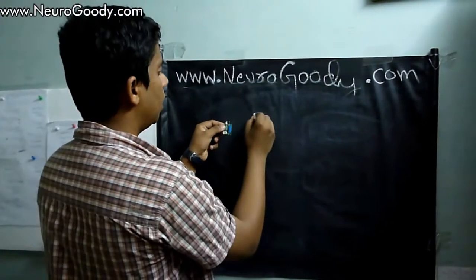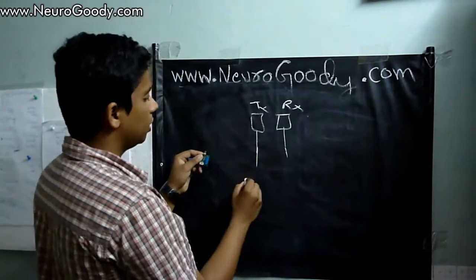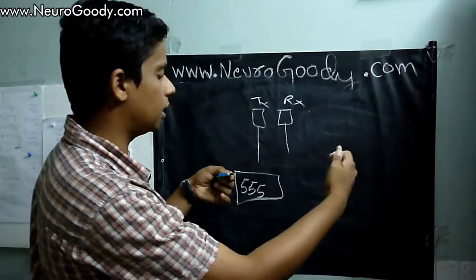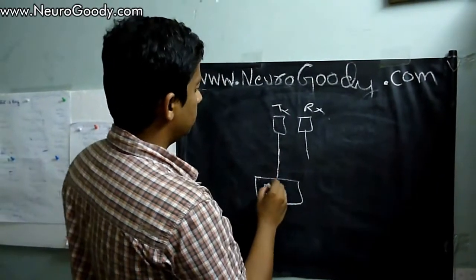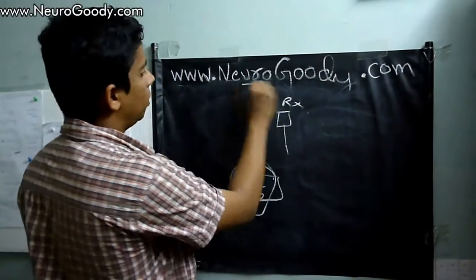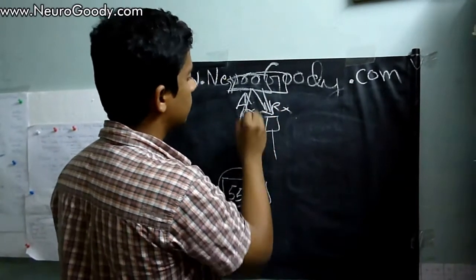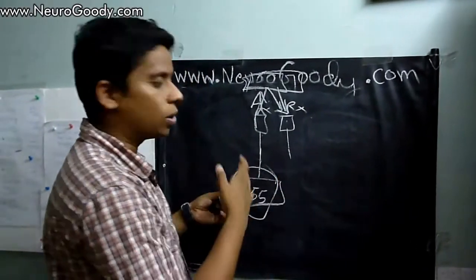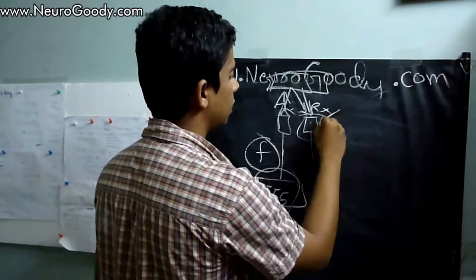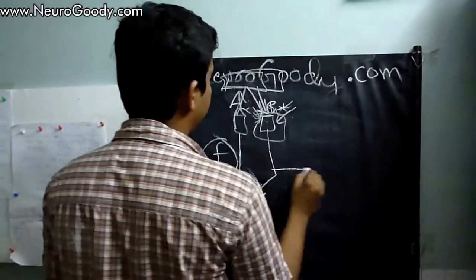This sensor has a TX transmitter LED and an RX receiver infrared LED, both controlled using the 555 timer IC. The basic idea for maximizing the sensor's range is to send a series of pulses from the TX at a particular frequency using the 555 timer. If an object or obstacle is present, the infrared rays will hit it and reflect back. The receiver will receive all ambient infrared frequencies as well.